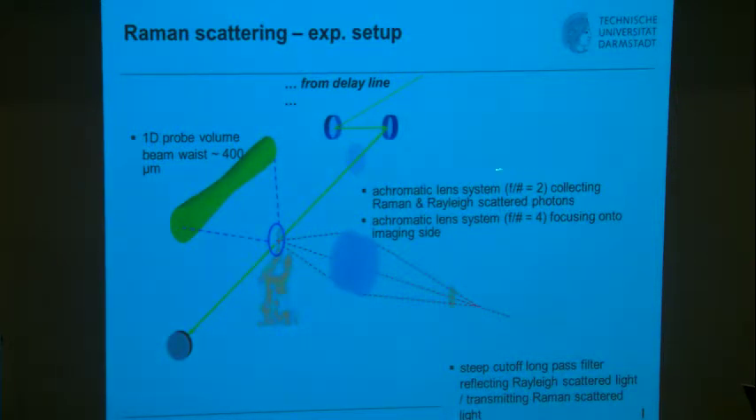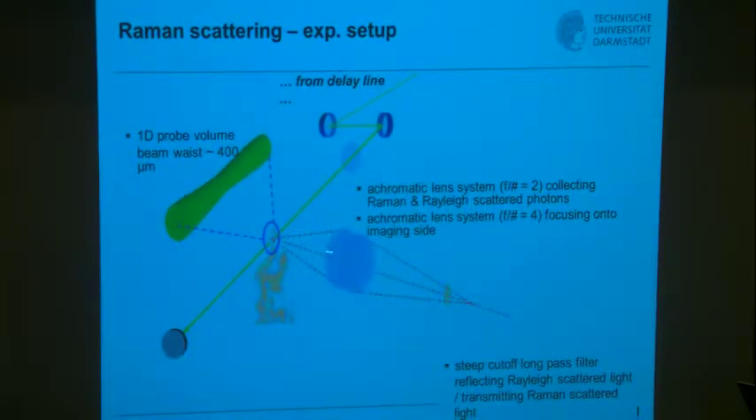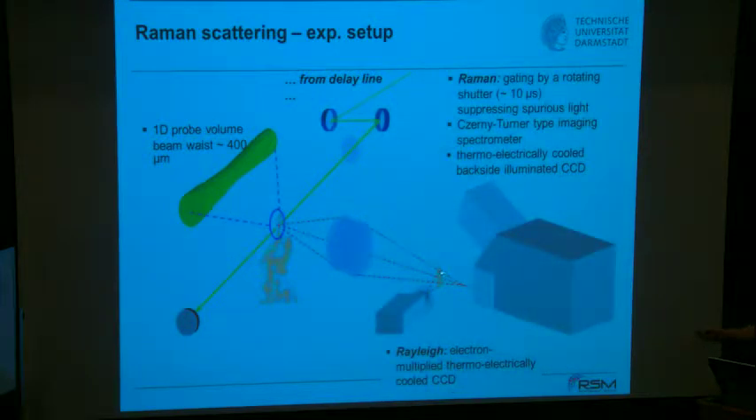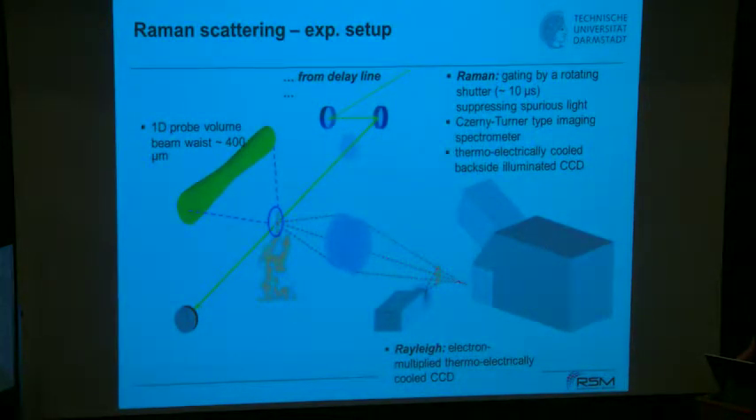This is a custom-fit design with an f-number of two and a working distance of about 600 millimeters — rather large optics. At the exit, the f-number is matched to the spectrometer. This older design used a commercial Czerny-Turner spectrometer with its deficits in transmission efficiency — roughly 40 percent. The spectrometer had the same specifications as the transmission grating design: 300 millimeters, 1200 lines per millimeter grating.